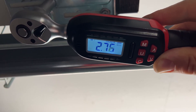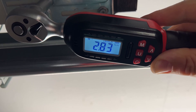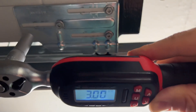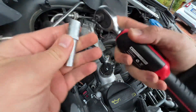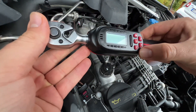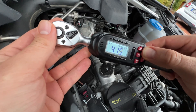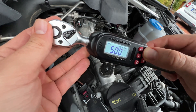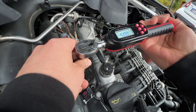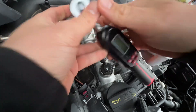The LED light-emitting diodes will give us information — the red LED will show us when the preset torque value has been reached, meaning stop now. This is also a bi-directional torque wrench available in two modes: the peak mode, which only displays the maximum torque value, and the track mode, which can display the torque value in real time. We can configure the measurement mode according to our preferences.